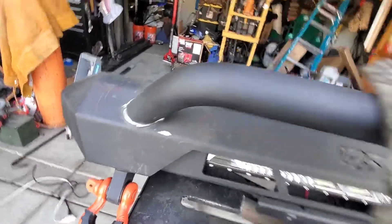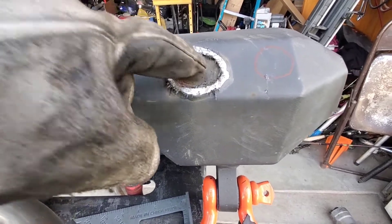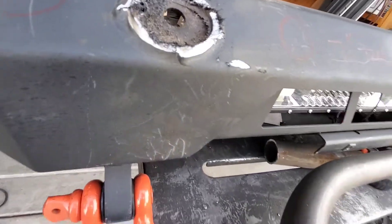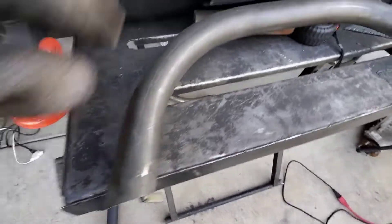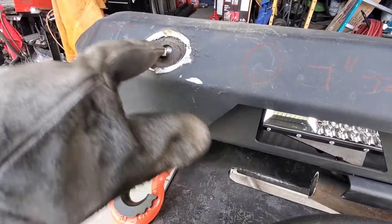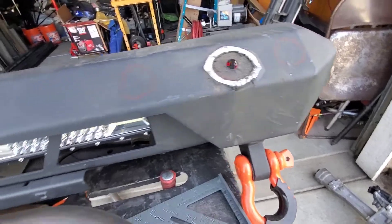I got this thing cut off. I'll show you how it looks. See that — it's got a hole here. I know why — ventilation. And here as well. So I'm going to grind this off to where it's nice clean metal, and then I'm going to have to weld this hole in and here to repair it, so that when we paint, you can't tell the difference.